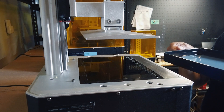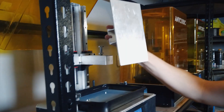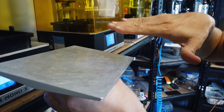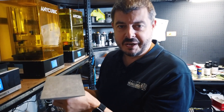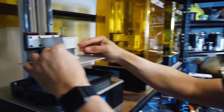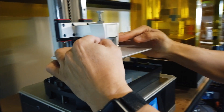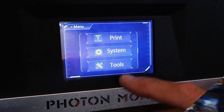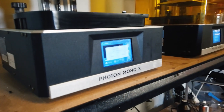The bearings are all fine on this machine. The build plate is the same as the original — the surface is essentially just sanded flat. A lot of people have been saying they've had issues with it coming out of the box slightly bowed, and they've resolved that by sanding it on a flat stone. Fortunately we haven't had that issue on any of our machines. One thing I did end up doing is taking the U-plate and squeezing it in slightly so there was no gap between the two sides when you tighten the screws, and that solved a lot of problems for me as far as levelling. The controller in this particular machine is definitely faster — the screen refresh is a lot faster and it's more responsive on the touch screen.